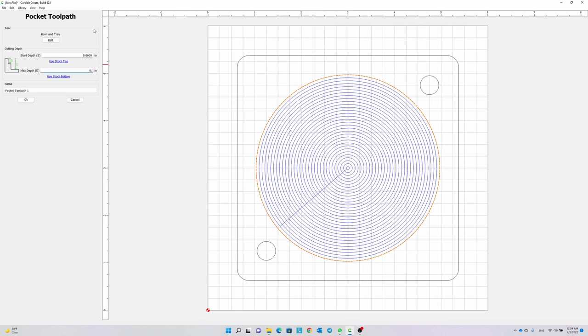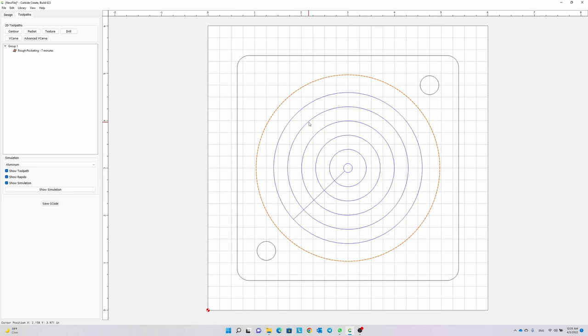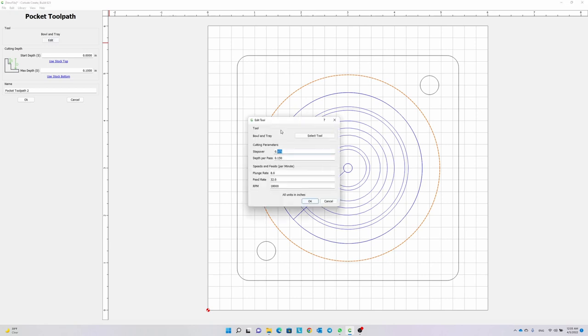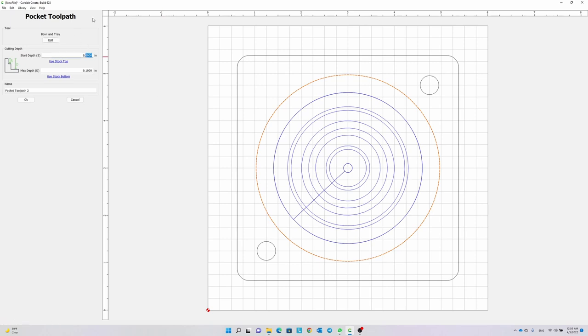I am going to use a bowl and tray bit for this toolpath. The bowl and tray bit is pretty much like a straight bit, but with rounded corners. I will leave a link in the description for the one that I'm using. Eventually, I want to dish out to a depth of 0.95 inches. So I create a rough pocketing toolpath with higher values for step over and depth per pass from the surface to 0.9 inches, and a finish pass pocketing from 0.9 to 0.95 inches.